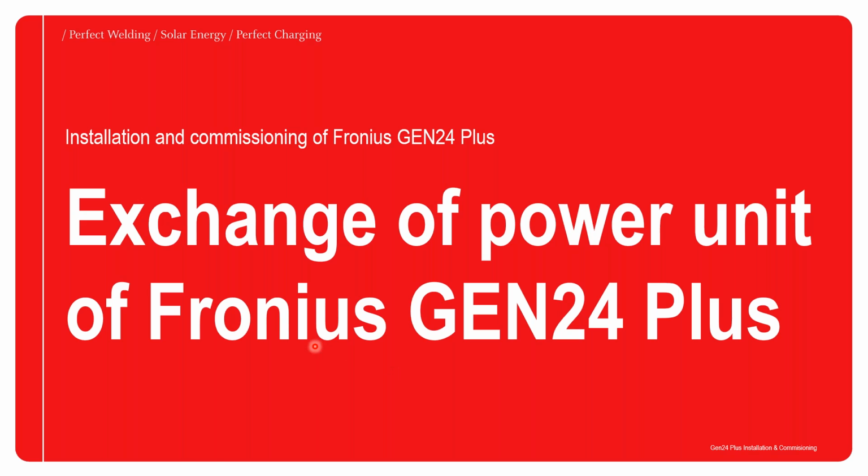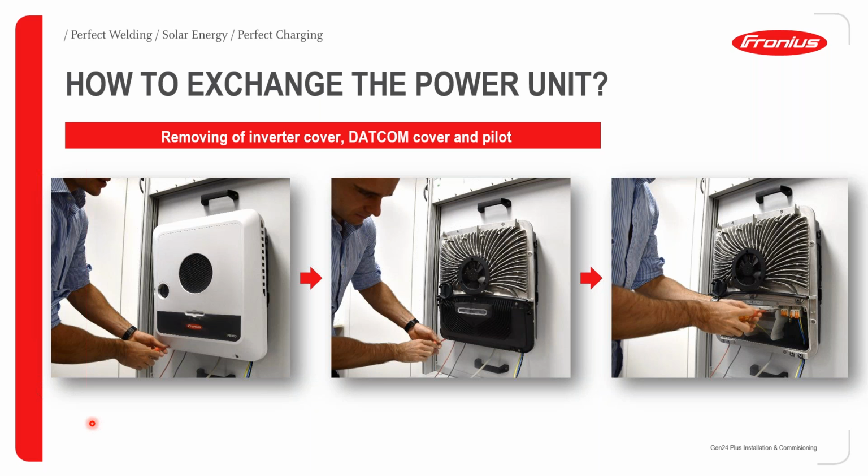Looking at the exchange of the power units of the Fronius Gen24 Plus inverter. In order to exchange the power unit, you have to remove the front cover of the Gen24. You then have to remove the DATCOM cover. And once you've done that, you then have to remove the pilot, which is the communication card.